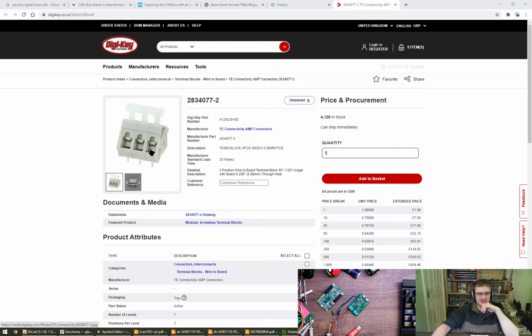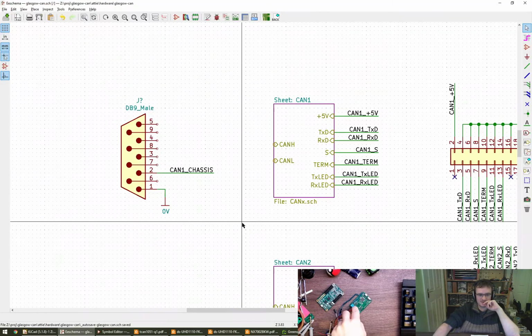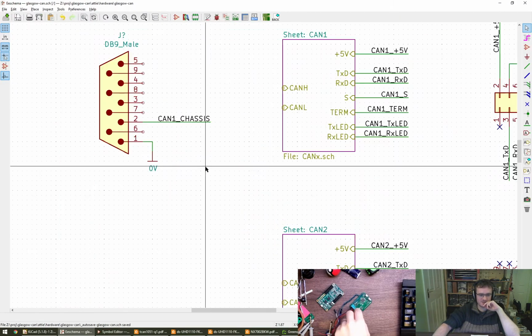So my thinking basically is that here we can just put a wire in from CAN low to 0 volts, and that can be our sort of really lazy way of facilitating this. If we then decide that actually yes, it is possible to do that with the TCAN1051 or whatever it was, then I think it might be worth adding that as a jumper or something that you can plug in. So I think I'm okay to leave that if everyone else is alright with that too.